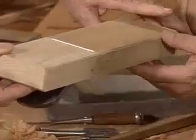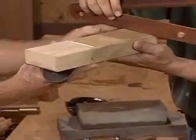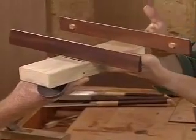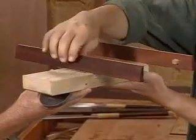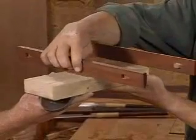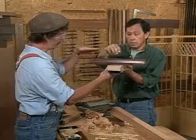That's helpful. Now, how do you make sure that these things are lined up? Okay, you haven't got it twisted. Right. You'll take your winding sticks, which is a traditional tool in any woodworking tradition. Yes. We all have errors to amplify. Exactly. And what the winding sticks do, of course, is they amplify your error, and you'll sight across them to make sure that the sticks line up exactly. And by just scraping gently with a chisel, you can adjust this surface to be flat. You can check for flatness, and also that these two are not in winding. They're just a straight, flat plane there.